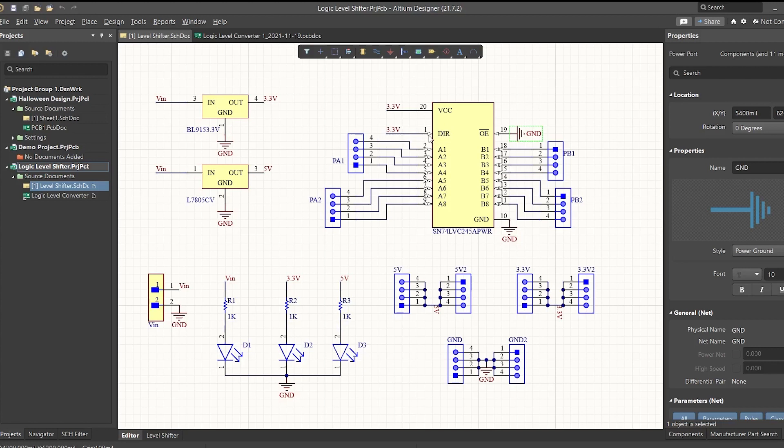You can connect an input voltage at pin VIN — it can be any voltage between 7V and 32V, such as a 9V battery or a DC voltage adapter. There are indicator LEDs at various points for easy troubleshooting, as well as 5V headers, 3.3V headers, and ground headers for powering up the microcontroller and sensors.